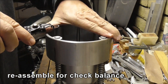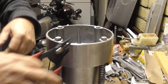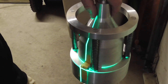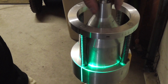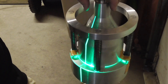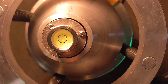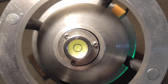So I'm reassembling the snap rings — push it down, get one over, just hold it — now I've just got to put the other four on. I've got the laser line again and it's just barely clipping that top edge. When I rotate it, now it's a lot thicker — quite a bit thicker there — gone past halfway, and it's almost vanished. So by the time I put this frame back on, it's out of balance again. Looking at the bubble on top, I see it's off to the upper left this time. I can't get a consistent bubble reading either.